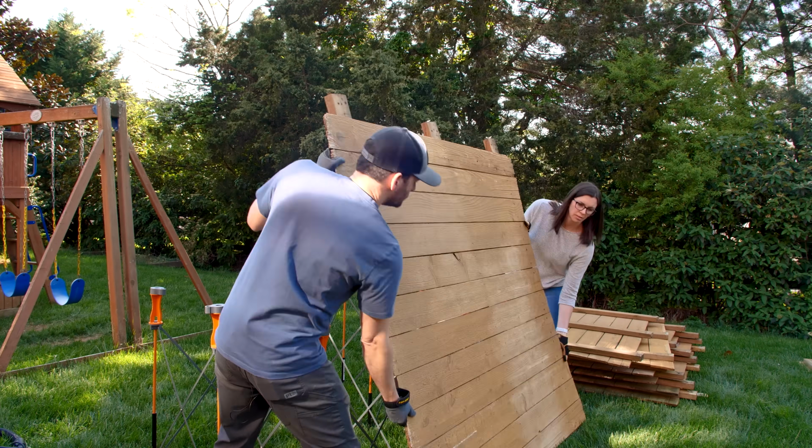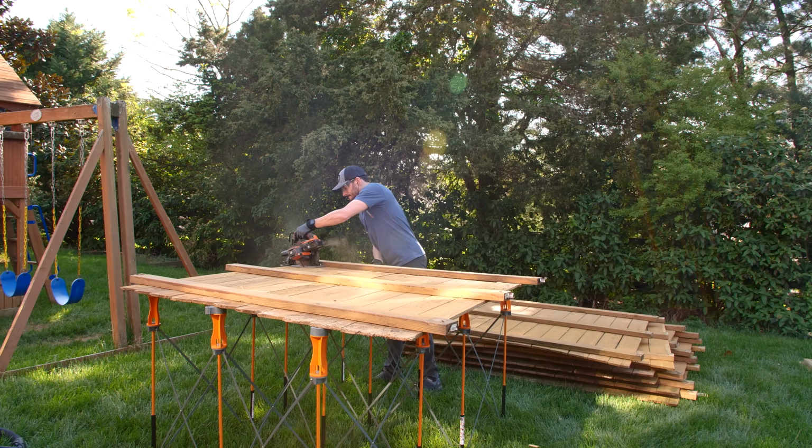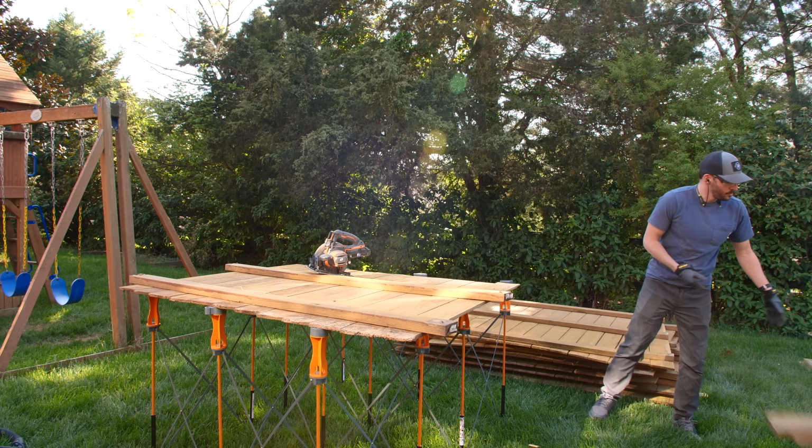We flipped the fence section over, and I decided to use a circular saw to cut the top and bottom rails off first. The bottom of the pickets were all rotted out from being in contact with the ground, so I wasn't really losing any good wood there anyway.